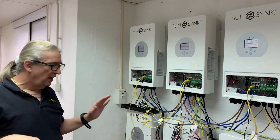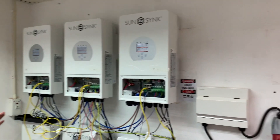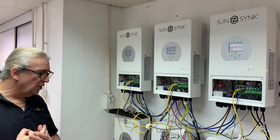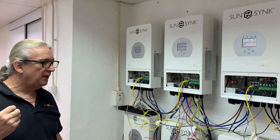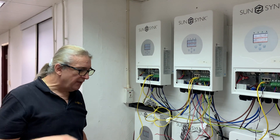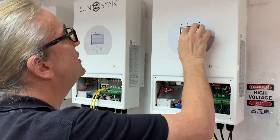So there you have it — this is basically wiring three phases with six inverters. I've got my three-phase running. Be very careful — it's 440 volts running off a three-phase socket. This is purely for testing purposes in our workshop in Hong Kong. We've done an improvement where we can parallel the generator input, and we're going to test that later today.